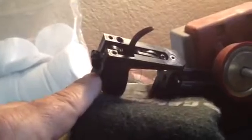And hopefully in a minute, when I go to install this back on, right here, you see that gap right there? That's the leaf spring. That's where you've got to push down, and that's where holding the two springs in becomes difficult, because you've got one right here for the feed cover, and then one right here for your nose cone advancement piece. I'm one-handed, so I'm not going to be able to show you it, but we'll see what happens.